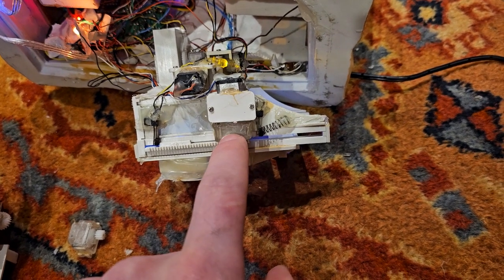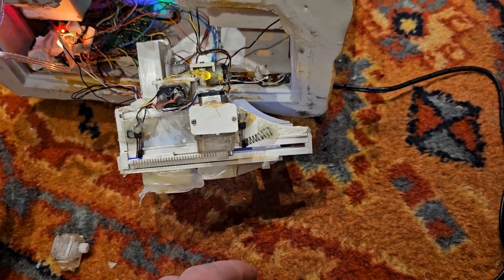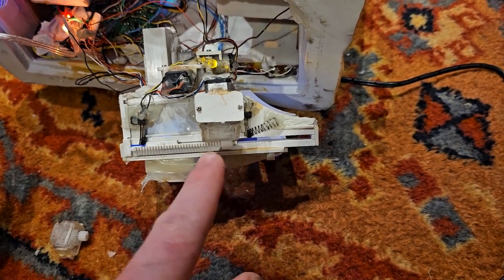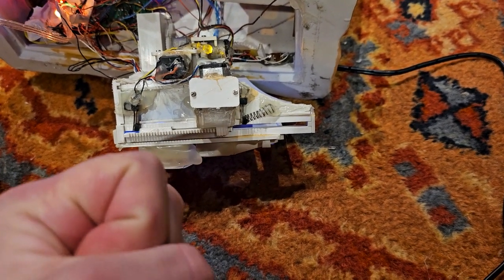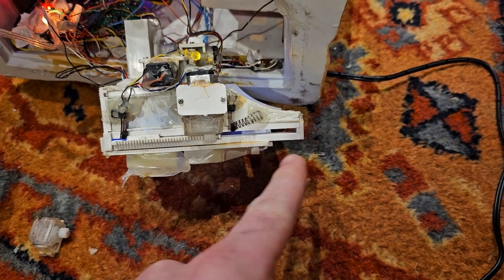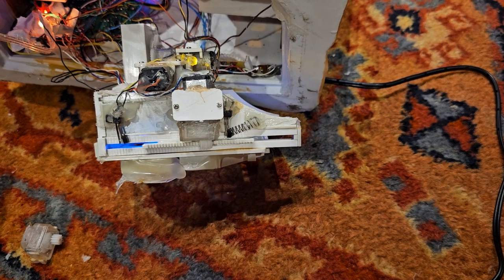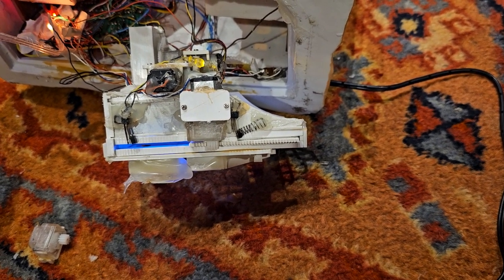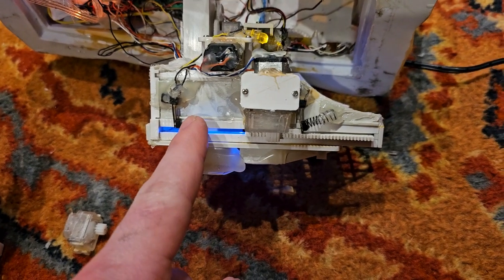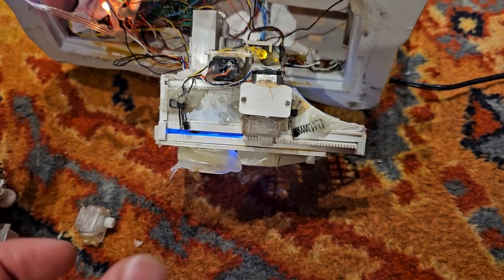But basically the combination of having these kind of servo-esque gearboxes, which are able to have really high output power, but these are plastic gears, so if they actually encounter something that has more force on it, like reaching the end point here, it slowly shreds the gears because they're plastic, and they shouldn't be supplying that much torque to something like this. But then basically these sensors here, they're forced to bend at these like extreme angles when they reach the top and bottom.